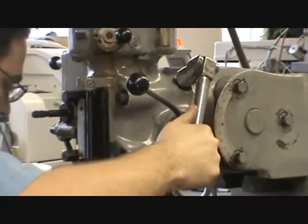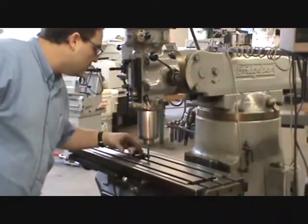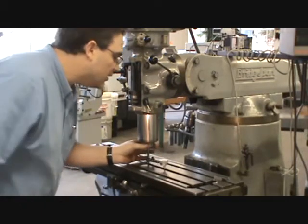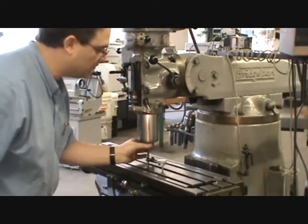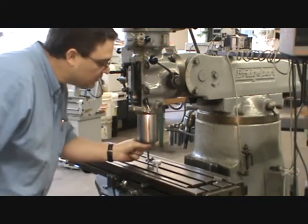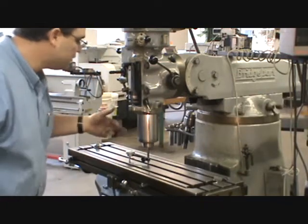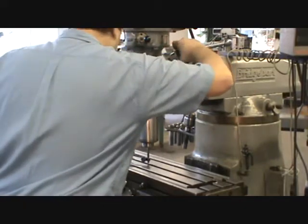Always zero here and adjust over there to avoid confusion. I'm zero on this side; rotating to the other side I'm about 12-13 thousandths off, counter-clockwise again. Because it went the same direction, I know halfway didn't do it, so I'll go a little more than halfway this time. If the pivot pin on the head is tight, you should be able to do this in just three or four tries.